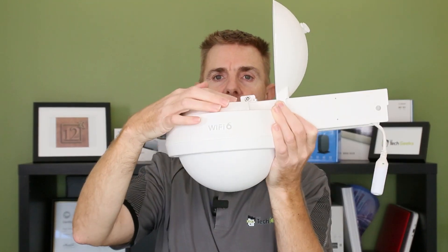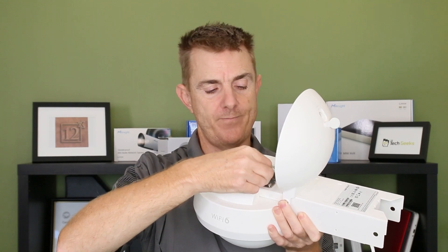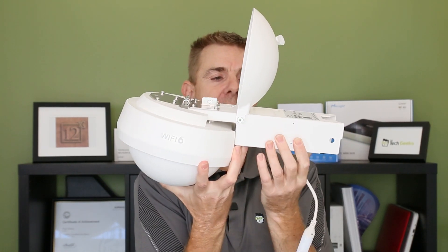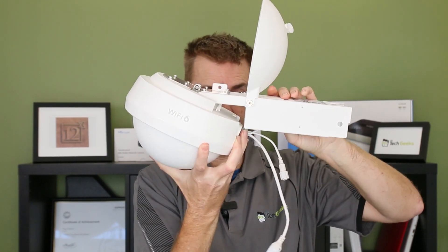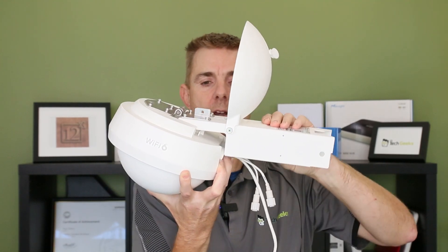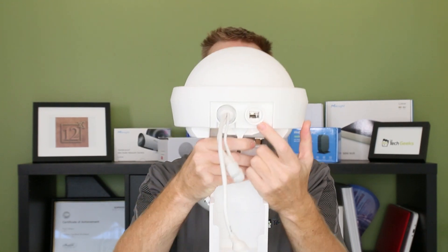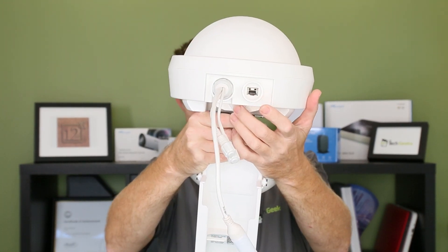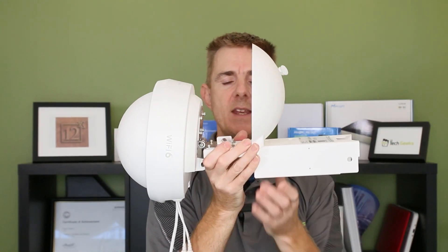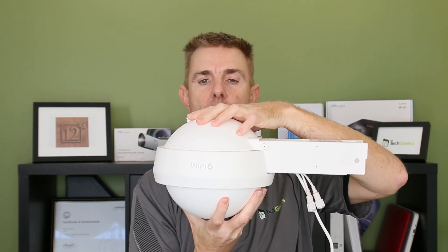As that opens up, you can see there is a hinge here. There's also another retaining bolt — let's remove that too. Now we have an amazingly great feature: we can actually angle the head completely vertically and open it up. Pulling it round gives you clear access to your SFP slot. You will need to put a transceiver in there — it's not included in the box — and you choose single-mode or multi-mode. With the head angled open like this you now have an easy way to connect everything up, feed your cable back through, then push the head back into place and fix the whole unit back together.